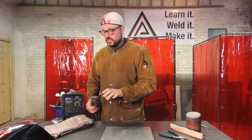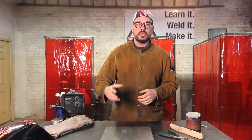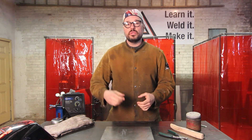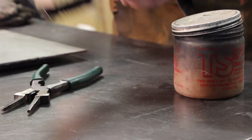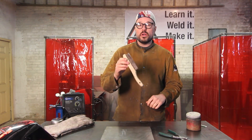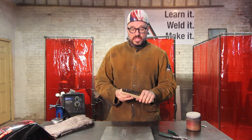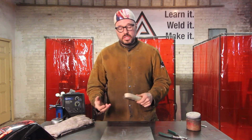When you're talking about welding, cleanliness is next to godliness — you should always have a very clean weld zone. When prepping your material you want it shiny and silver; no dust, dirt, debris, oil, rust, or paint. So every time you are welding it's a good idea to have a stainless steel wire brush around. This will come in handy in between tacking and welding to remove carbon burn buildup.